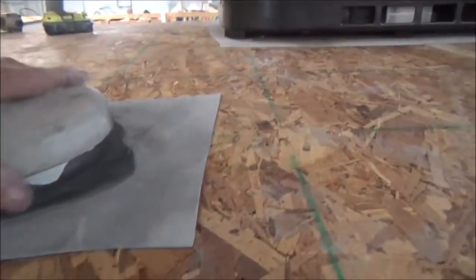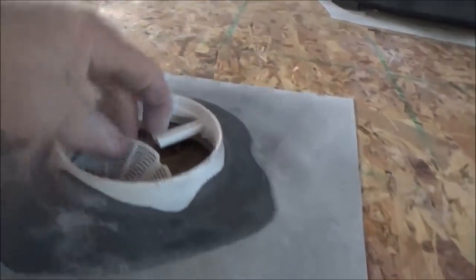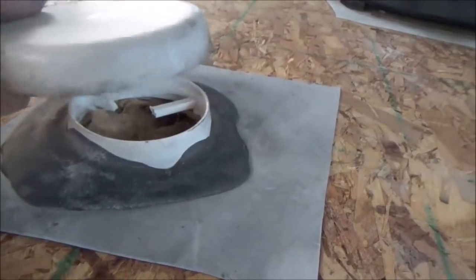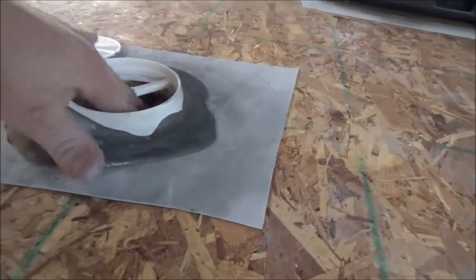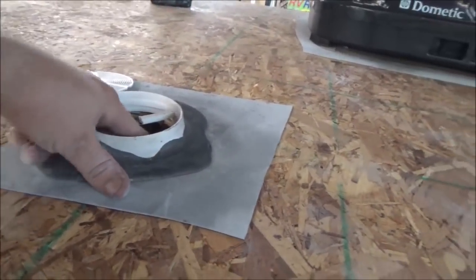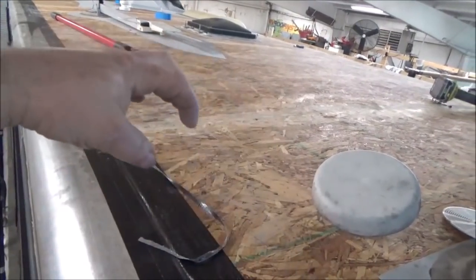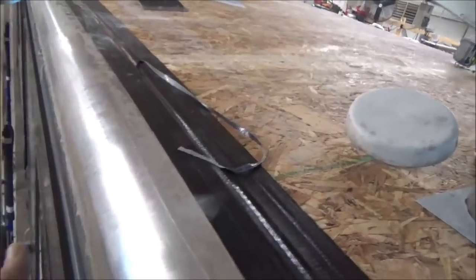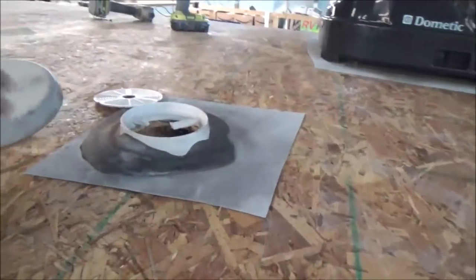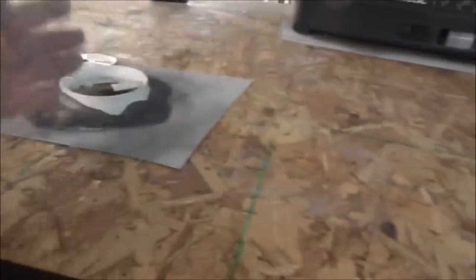I'll bet this is supposed to be a roof vent - yep, that's what it is. This is their idea of a roof vent. I don't know how it's going to vent because of all that insulation in there blocking it. They use this as a marketing scheme, saying they gave you a roof vent to help get heat out of the attic area. It isn't going to do anything - one because you got insulation blocking it, and two because on any roof you need a soffit vent on the eave and a ridge vent on the top. You don't have anything on the bottom so it can't draw. We're going to end up blocking that hole up - it does zero.